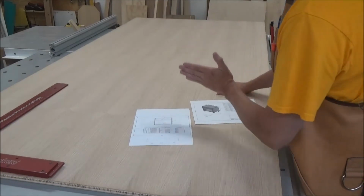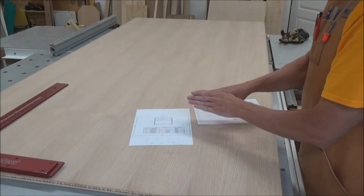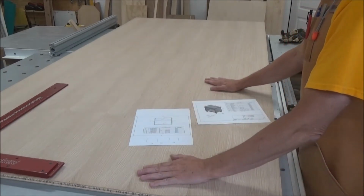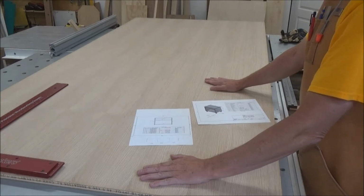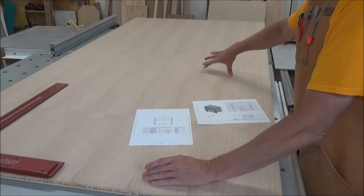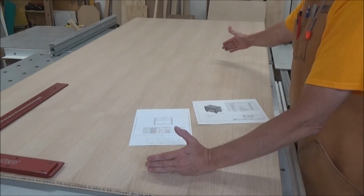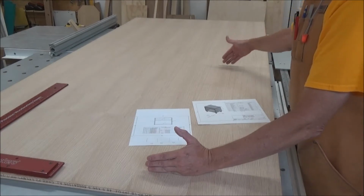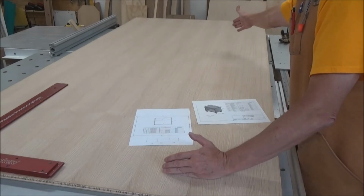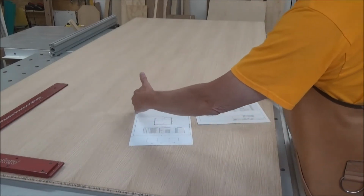When you do a long miter cut like that, you've got to have a nice, tight, clean joint. So I really got to take my time and set up that 45 degree miter. The height of the side is 23. The length of the top is 28. And then 23 again. So it's got to be 23, 28, 23. And then, like I said, 19 3/4 wide.